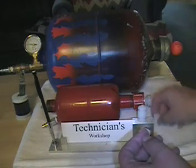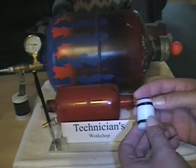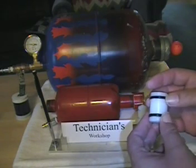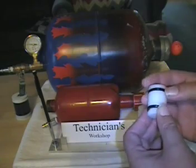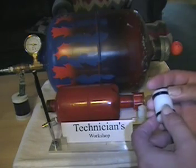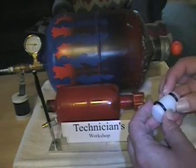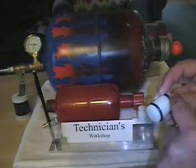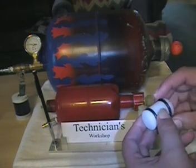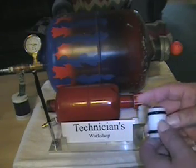With that in mind, if we take O-rings and put them on a piston so they're really loose — I've heard on the forum Spud Files that they like to use what's called floating rings. This is basically what it is: a floating O-ring. The O-ring is free to spin, it's loose, with lots of space underneath it. A lot of times people figure the area underneath the O-ring has to be big enough so that when you jam this into a space and the O-ring gets squeezed down, it hits the bottom of the groove. All that does is provide a seal, but it also increases the pressure immensely and makes the piston hard to move. What we want is a piston that is easily moved.